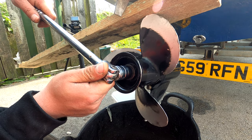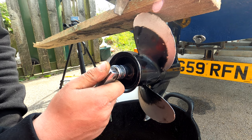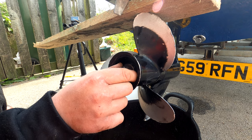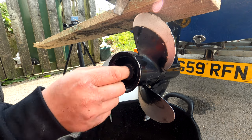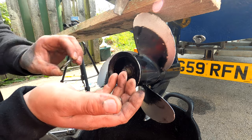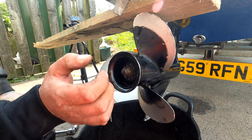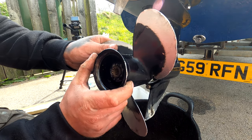With tools, you shouldn't be using a ratchet to crack a nut as tight as this — you should be using a breaker bar, you'll damage the teeth in your ratchet. I'm going to pull down slowly, watching I'm not damaging anything, not on the anode. There we go, it's just released. So we've got the castle nut off, then a washer — lay them on the floor in order so you don't get mixed up. The prop should come off now — yeah, there it comes off.